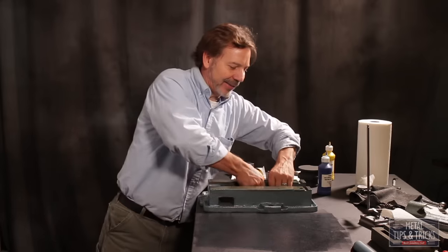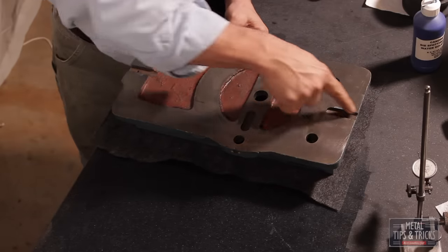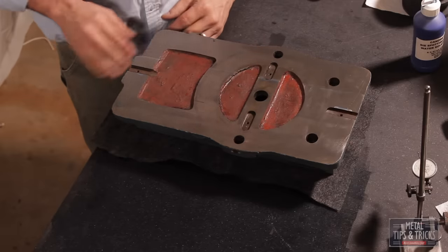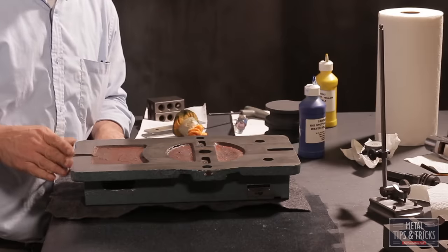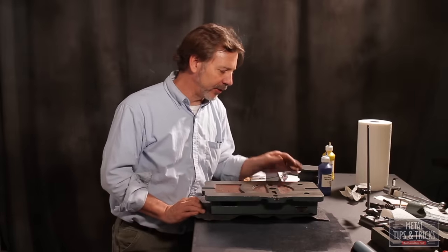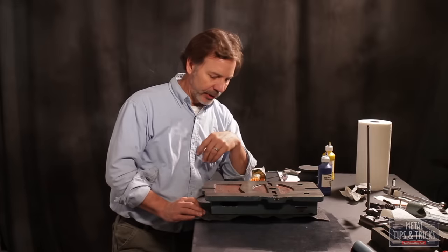Let's take a look at the back side. You can see we've got some blue here and here — those are all our high spots. It'll be interesting to see when I start taking this down how flat we can actually make it. I've got some challenges putting this on the surface grinder because it is rocking, and the high spots are so extreme that when I clamp this down on the magnetic chuck, it could twist it or pull it down. So I've got to think carefully about how this goes onto the grinder.